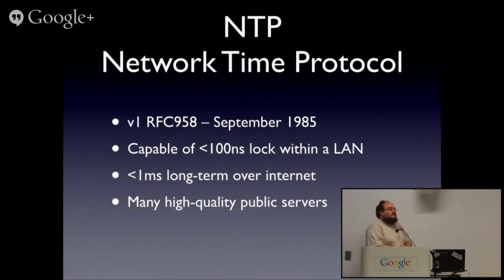Now, we're computer people. We like making our computers talk to each other. There's a whole bunch of other protocols for this. Most of them historical proprietary, but the master of timekeeping for pretty much every computer on the planet that's not plugged into a cellular network directly is NTP, the Network Time Protocol. Version 1 dates back to 1985. Version 3 is the... Actually, is there version 4? There's a version 4. Okay. So this is what your computers actually use to synchronize each other. Most PCs will actually use something called SNTP, or Simplified Network Time Protocol, which is just if you want to go, what is the time now here? It does delay compensation. It's more complex than that, but I actually won't go into the full details of it.